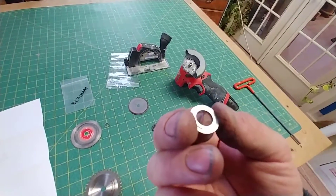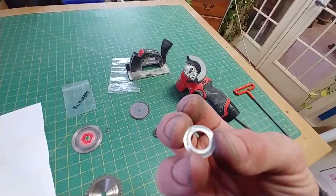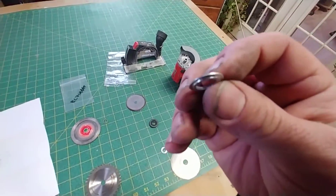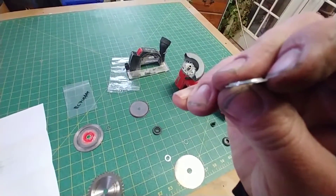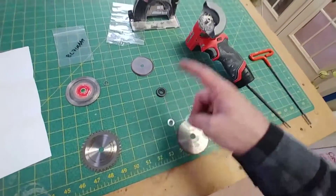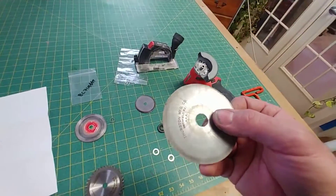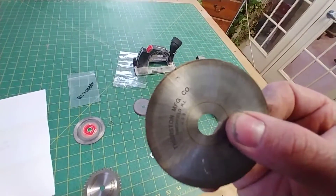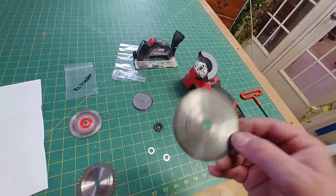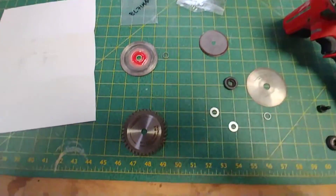The part I'm holding is five-eighths of an inch, which isn't super important — I just wanted a shoulder, and the outside of the shoulder is half inch, and obviously the hole is three-eighths. The shoulder height is 20 thousandths of an inch, so it fit with the blade. I had some success, but it wants to wander a lot because it's so thin, and it also got pretty hot due to the high RPMs and the very high tooth count — just a lot of friction. Same problem I had with the razor blade from a fabric cutting razor when trying to solve this problem.